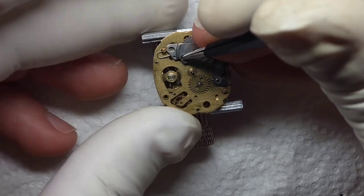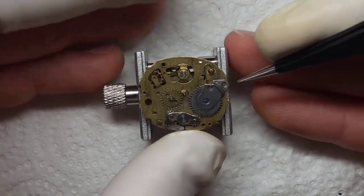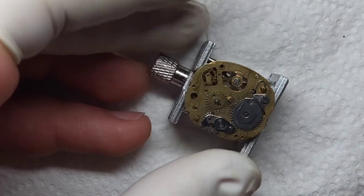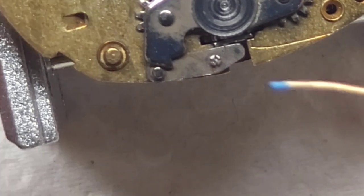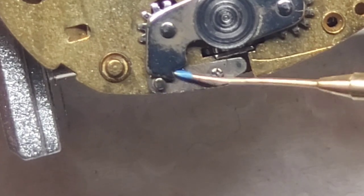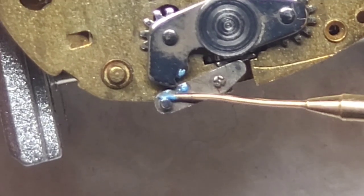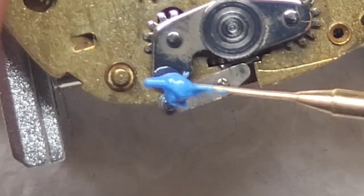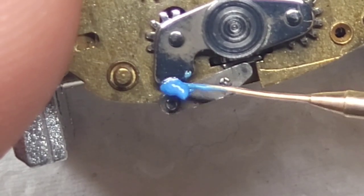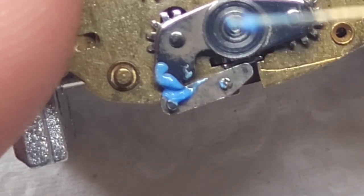What I've got to do is drop on this retainer for the ratchet wheel, which is on a little dowel. Just push that over to the dowel, get the screw in before it changes its mind, and tighten it up. On this side there's not really much lubrication to do at all, just a little bit on this keyless works. Because that crown had come off, it seemed like it was having additional force on it. It's only splined, not retained, so it should be easier to operate than it was. It was just dry before, so we're going with some lovely synthetic grease - blue flavor, my favorite.